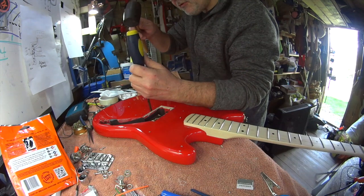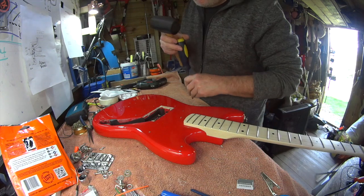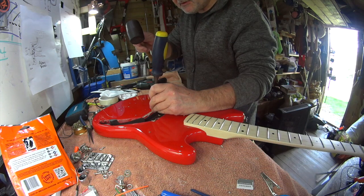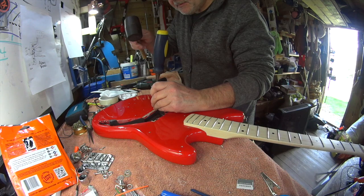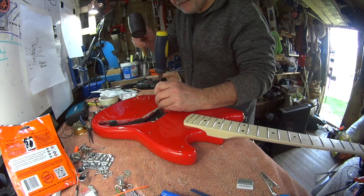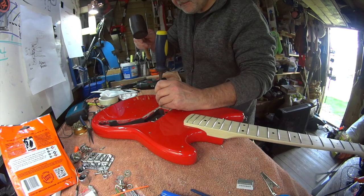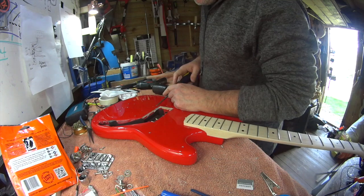Important thing, if you can try to remember, is to keep your original line going, so don't ever go down so far below it that you lose track of where it was, because the original line is your mark of straightness really. So it's good to be able to find it again, regardless of what you're taking out. See my original line.